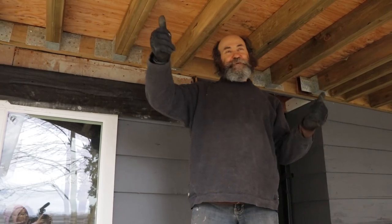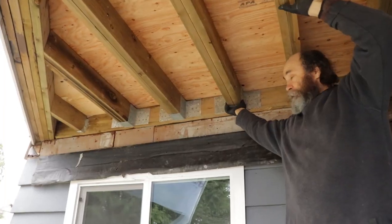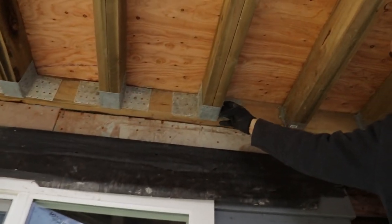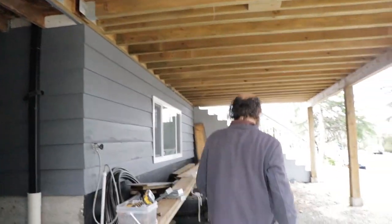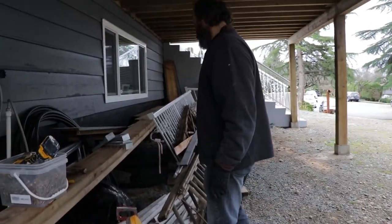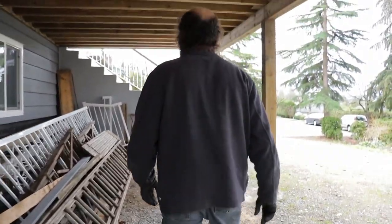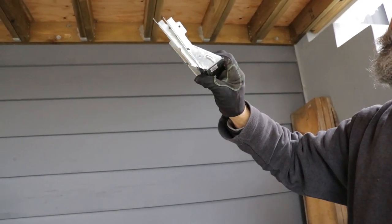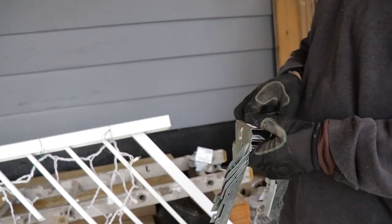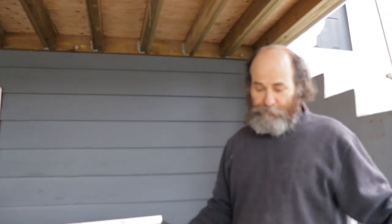Back on the deck — I just put some hanger joists in. These are good ones I had kicking around. I also have double hangers here, which are very solid. Beside that I'm gonna put a plate and some really long screws to support the deck to the house really well. This is all being done on spare time — I have a few hours today.